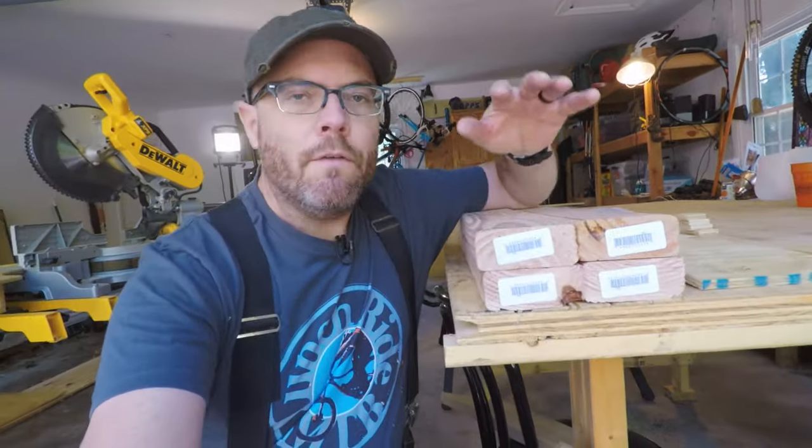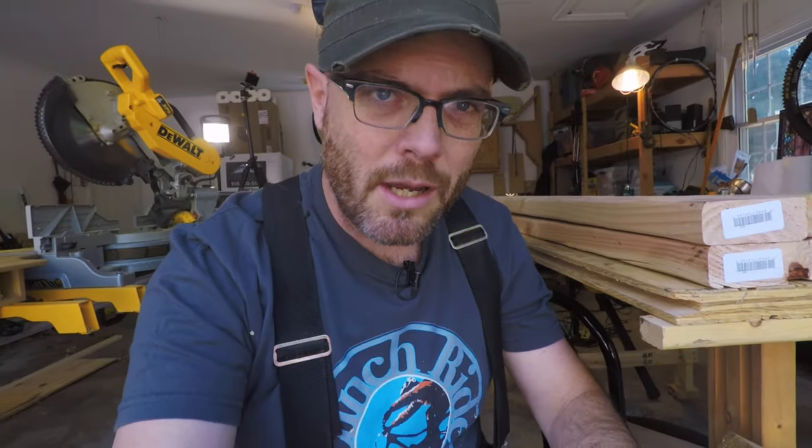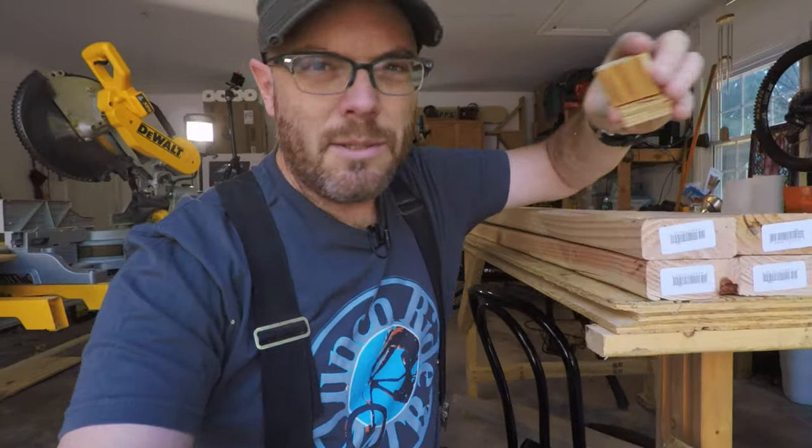For the stand I'm building, all I really need are four 8-foot 2x4s and a sheet of half-inch plywood — actually just a 2-foot by 2-foot piece is all you need. You can buy a pre-cut 2-foot by 4-foot piece at Home Depot or Lowe's, which will give you enough for the 6-inch shelf that goes underneath and some little feet to make it more stable on the ground.